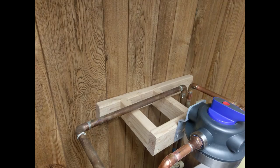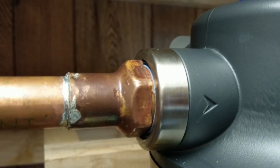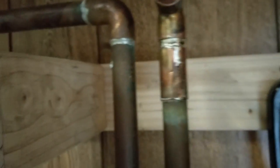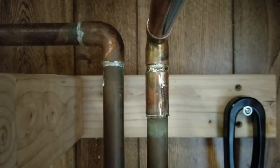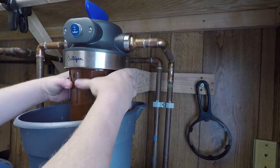Here's how I installed the filter — it's in pretty much the most convenient place in the space that I have. I made a simple wood support and used the bracket that it came with, and I went the pipe soldering route. I know this job may look ugly if you're a pro watching this, but hey, it doesn't leak and that's all I was after. You could also use SharkBite fittings with this if you wanted to — it's much easier than sweating copper, but those things aren't cheap and I already had a lot of the supplies on hand. If you're not comfortable doing this job, just call a professional.